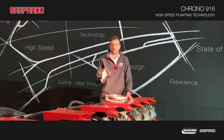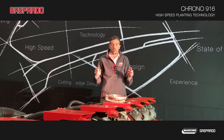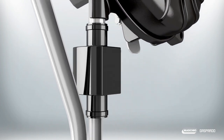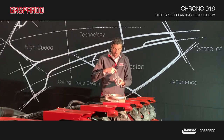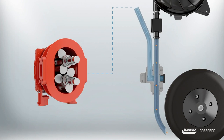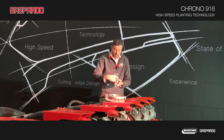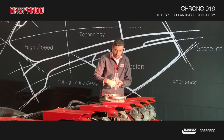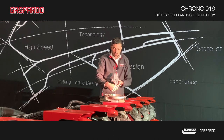The consistent spacing among seeds in the furrow is kept really uniform. The unique and patented system of Crono guarantees uniform seed delivery thanks to an airflow that comes from the compressor, goes down to this tube, and meets the seed delivery tube at a point where it creates a small tornado that creates suction from the top and blows the seed down to the bottom. The speed is uniform and so the spacing among seeds.